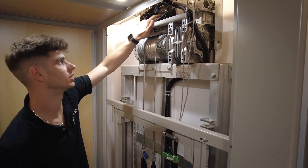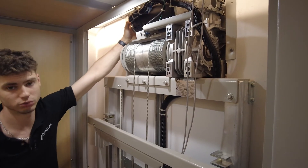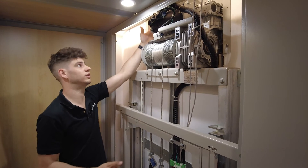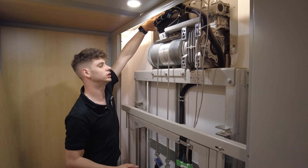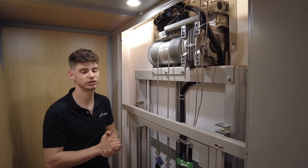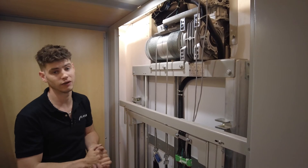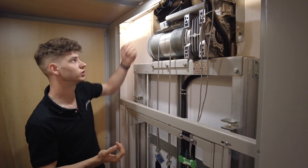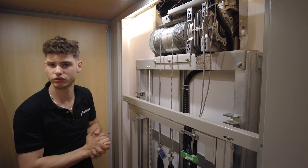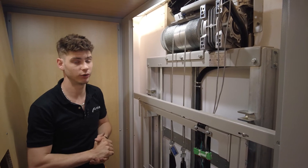The motor up here has a large electrical brake that is automatically disengaged and engaged when power is applied to the unit. To test the brake, you pull on it. My unit slowly starts to come down, releasing the brake, confirming it's releasing. If it's a brand new unit and gearbox, it won't go down as easily — you need to break in the gearbox first. Pulling on the brake and turning it with a wrench on the tip of the motor confirms whether the motor is releasing the brake.